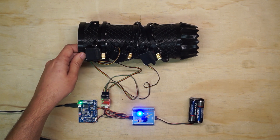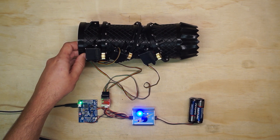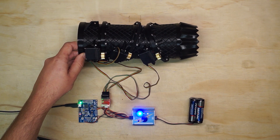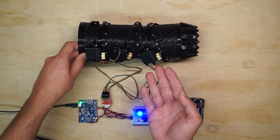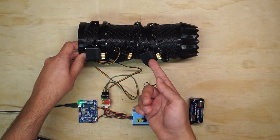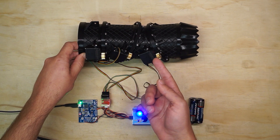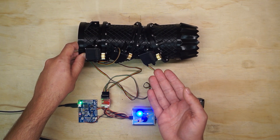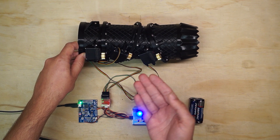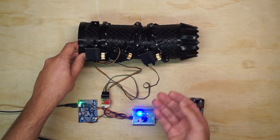I don't know if it was just the quality of the motors causing problems — I don't think I was overloading them at all — but I figured the best way to solve that would just be to transition to something that's a little bit more durable. The servos not only have a more durable gear train and overall construction than those gear motors, but they've got higher quality motors, better electronics, and that sort of thing.